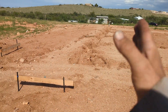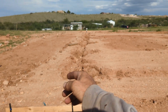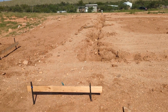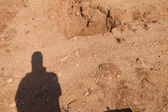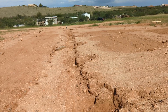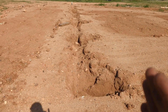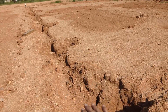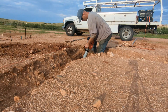Here we are — this is the front of the house, and this is the line that everything is going to be based off of, including the sides and the back of the house. The buck stops here. I'll run a line; you can see I've already got feathers in the ground from when we based the digging off of them. When I line everything up, it should be darn close with this hole here. Then I'll go through with the shovel and edge everything, and check that the stem wall area is 6 inches deep off that reference point.